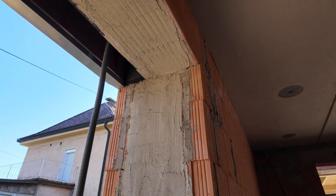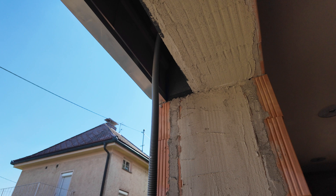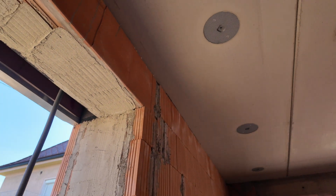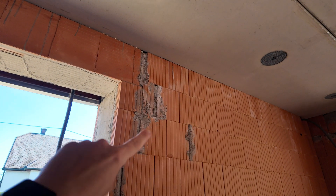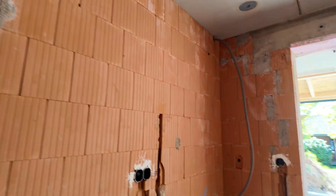Then we have outside shading coming — shutters with adjustable slats — and we have cables for each of them back to the cabinet. There is a decentralized solution like the Nano 2 relay, but then you would need a box in every room for every window. So we decided to go for a central solution with relay extensions.